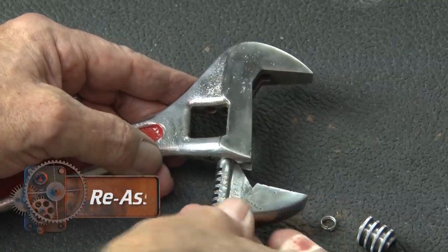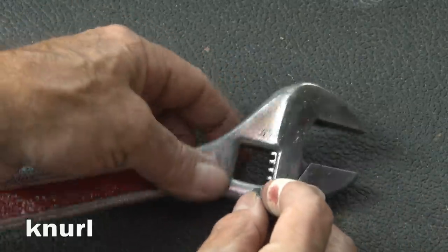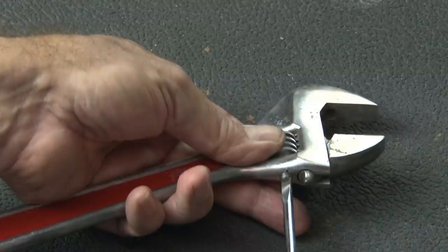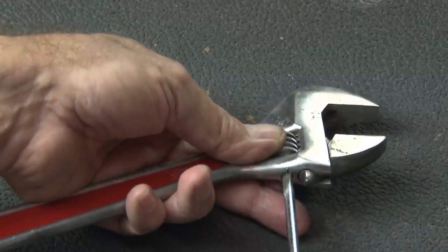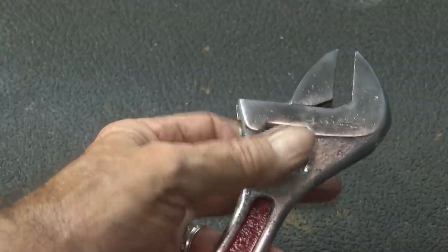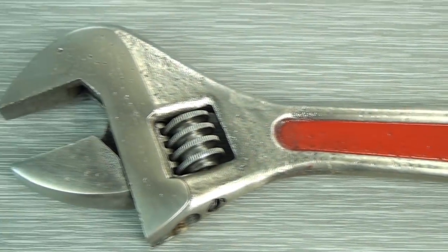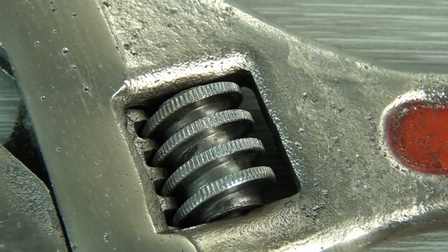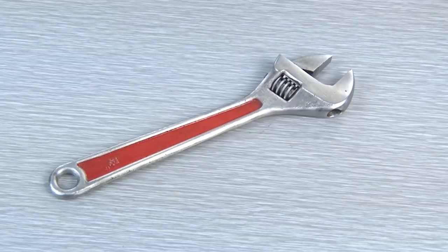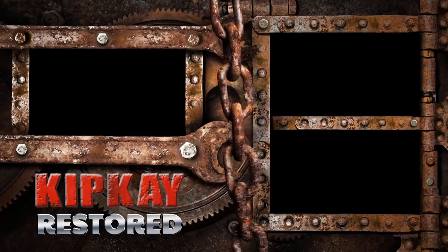Once it's cool enough to handle, it's time to unwrap it from its heat-sensitive tape package, and we're left with the inside area of our wrench powder coated a nice bright red. Time for reassembly — I'll slide the jaw in, insert that spring in the far end of our knurl, drop the knurl in place, and then run the pin through to hold everything together. Now that is a smooth spinning wrench — it opens and closes with just one finger, and I think it turned out looking pretty good. So wrench number two wins the wrench versus wrench challenge! Even though the first wrench beat me, I had a great time restoring the second one. If there's something you'd like to see me restore, leave it in the comments. Thanks for watching — we'll see you next time.